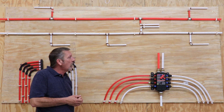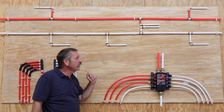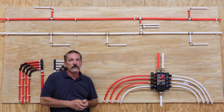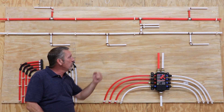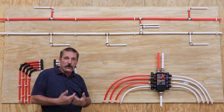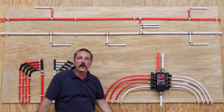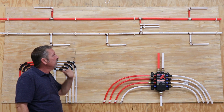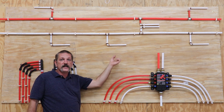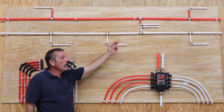PEX is really a good plumbing system — not a whole lot of leaks and it's designed to last forever. But historically in plumbing, where you have your problems is at your fittings if there is to be a leak, and that was true with all plumbing systems: CPVC, copper — fittings are a possibility for a leak. That's why when we do slab work and put PEX underneath the slab, we use the rolls with no fittings, because we don't want something to break under a slab. The more fittings, the more possibility, the more choke points. So it's cost-effective, fast, easy to run — the trunk and branch is the most widely used system.